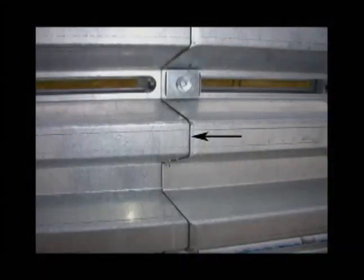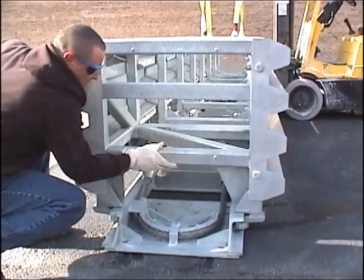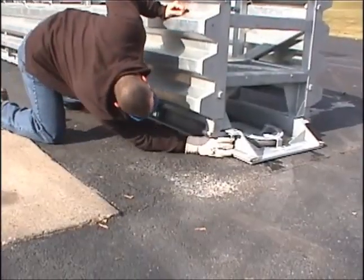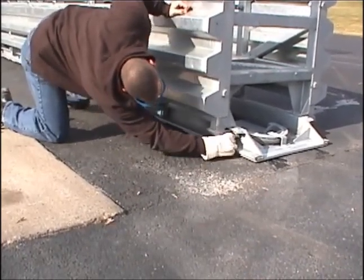Also, remember that the tapered trailing edge of a panel always goes on the outside when you replace the panel. Our front sled unit is very sturdy. Inspect the sled frame for any damage, then check the rollers that hold it on the channels. If there is damage, the sled should be replaced.